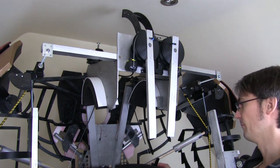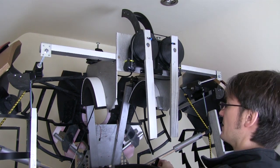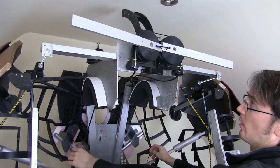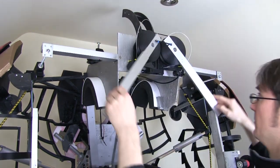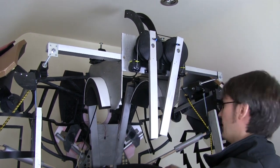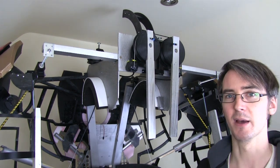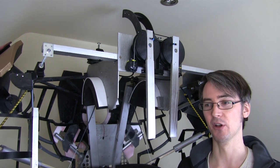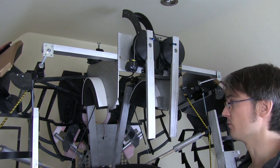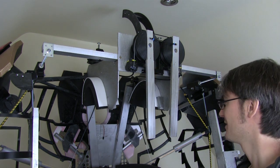I created this double-action assembly controlled with bicycle brake cords, which were going to be on solenoid releases. For now I've just hooked them on so it can work — it's a bit hit and miss. The aim is when they're released the mechanism pops out slightly and then hinges up. Eventually we'll do a servo or solenoid release mechanism so I can trigger it remotely to get in, and when I'm in the suit I can pull them down and hook them back on. I've got both options for safety — obviously you don't want to be stuck in the suit when it's on fire.